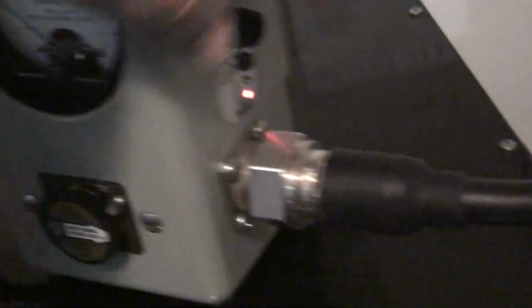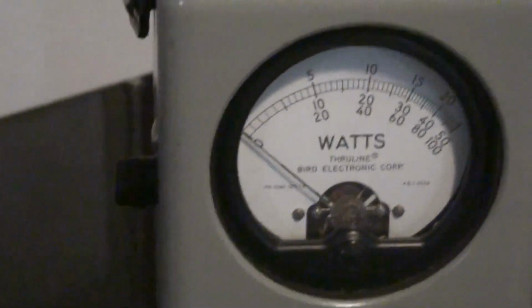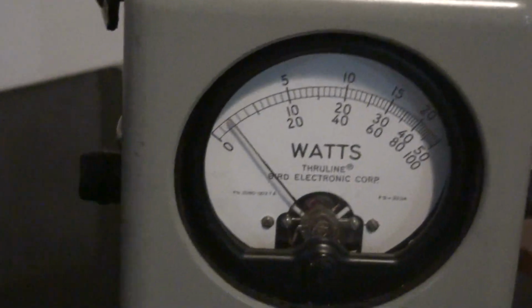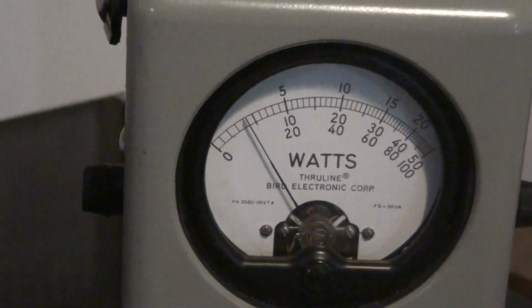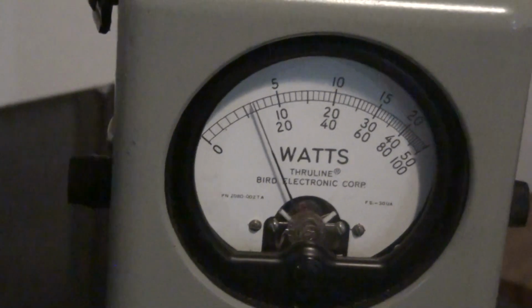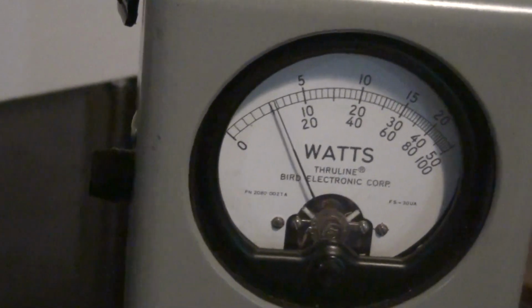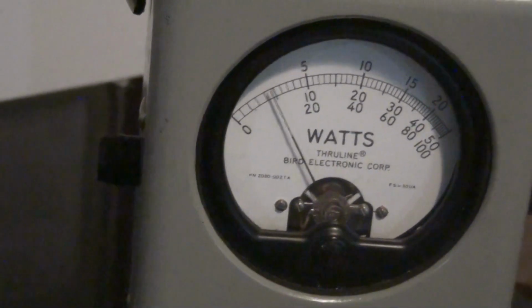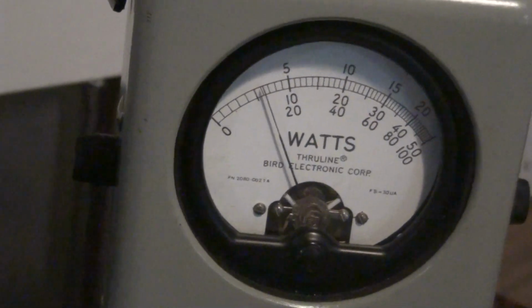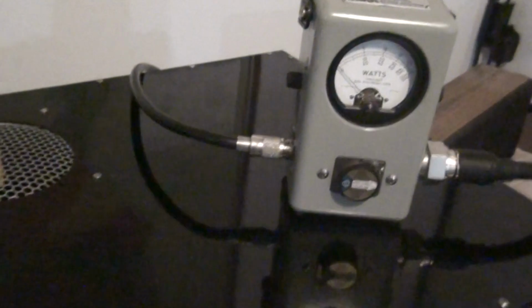Still running nice and cool. Gonna put it on average power now. Same scale, except we're reading average power. Key the amp, key the radio. First hash mark is 1,000. Bottom scale, audio test 1 2 3. About 1250 or so, you could probably say, not hardly halfway between the first hash mark and the 2,000. There she goes.